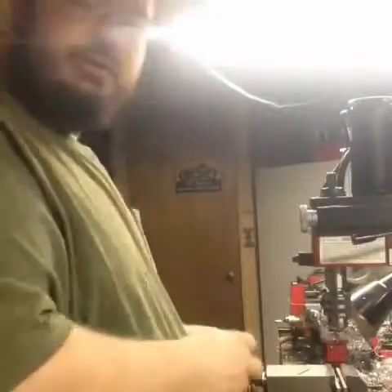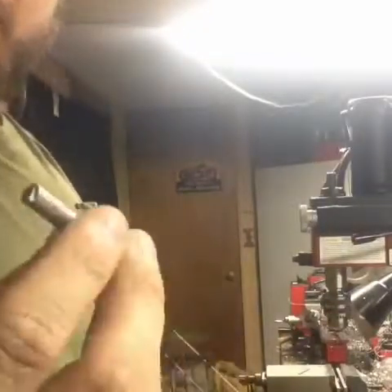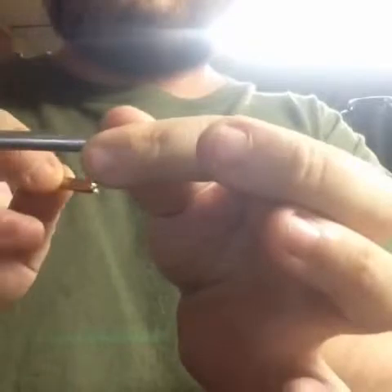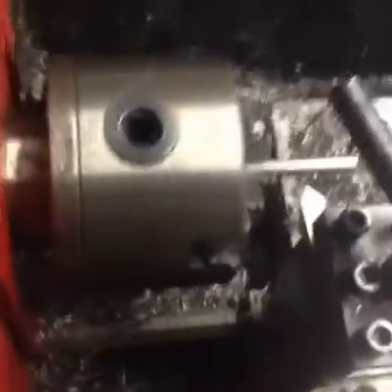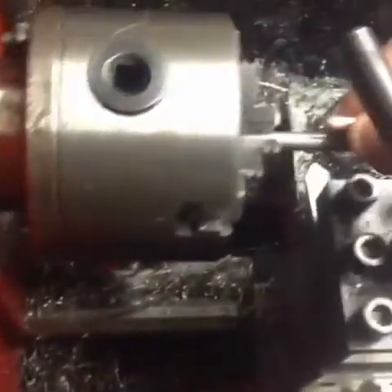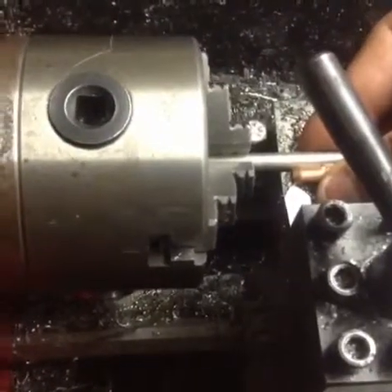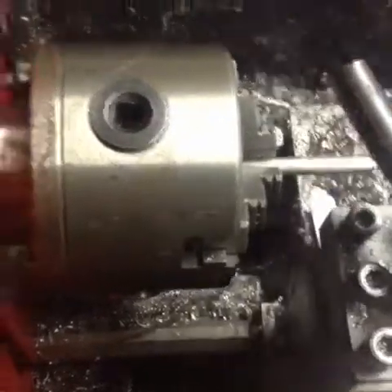This one, as you can see, is oversized at 224-225 - that's what you're wanting. Your first step is to get a piece of good metal and profile the bullet you're wanting to make. I'll try not to make this a lengthy video. I'm going to turn it down basically the whole length I need, down to the outer diameter of the bullet. Here's the first step: I've chucked it up in my lathe, laid the bullet up beside it, and I'm going to make a mark on the piece of metal the length of the bullet I want.